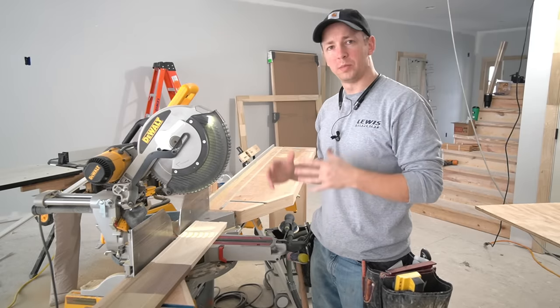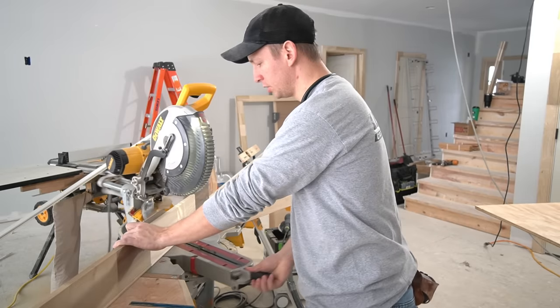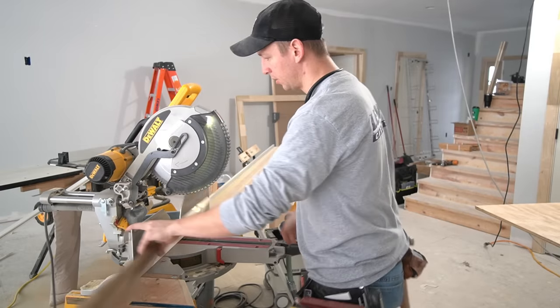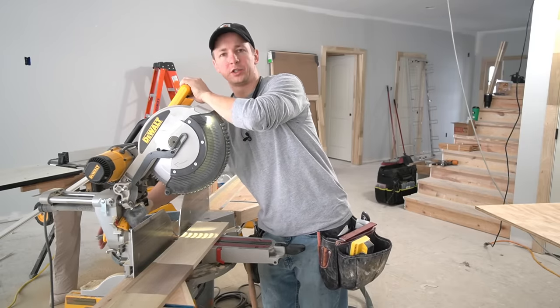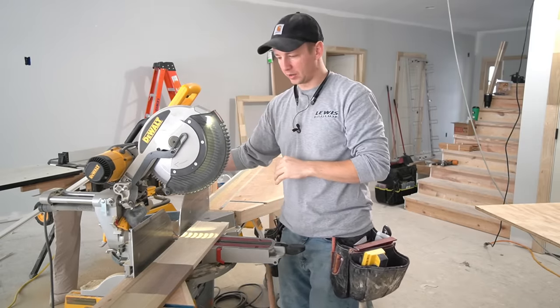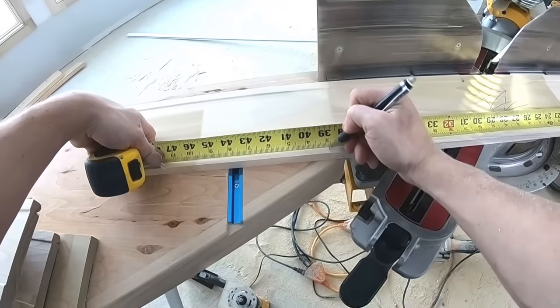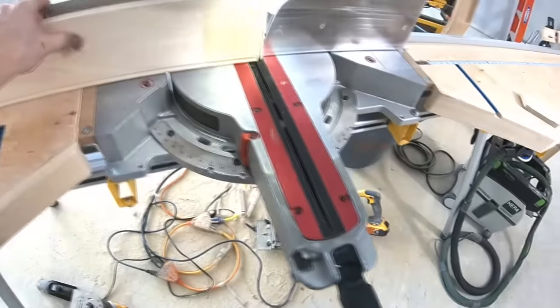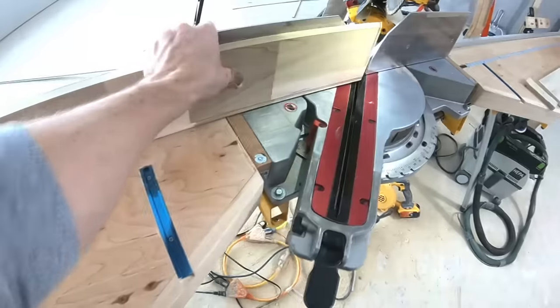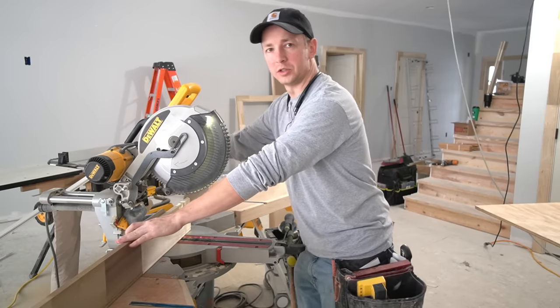The other key reason I like to cut baseboard vertically is because it is easier to move the miter function of the saw quickly and effortlessly, as compared to the bevel function where I have to reach around back and adjust that handle. As we're cutting our baseboard, we're going to be putting a lot of 45-degree cuts on our base for the cope, and then you need to quickly switch back to zero — or put a few negative degrees so your cut is at a slight angle. That's just a lot easier to do with the controls on the front of the saw versus using the bevel.